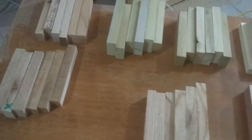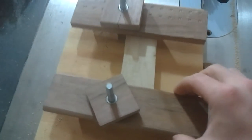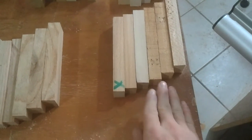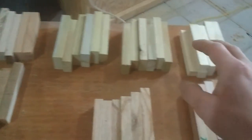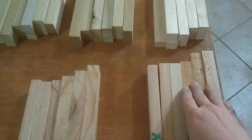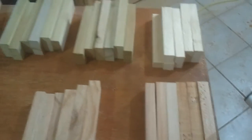42 pieces and 84 cuts later, this little jig has paid for itself already. The bottom face and the right face are perfectly flat and they are 90 degrees from each other. I've tried my best to rotate everything in the same orientation every single time. Now it's just milling it all down on the table saw to an appropriate width and height for joining them all together.